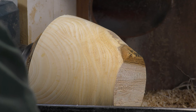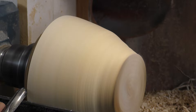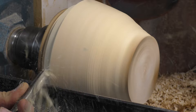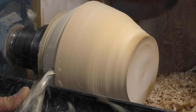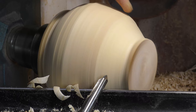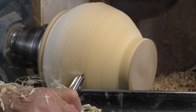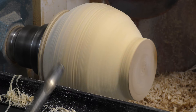Now as far as getting the shape is concerned, I'm going to just round this over at the top - just stay there. Cutting from the smaller to the larger diameter. I'm going to be down on to the plywood backing disc here, that's alright. I'm going to start to pull round the back here. I'm really looking at what's happening up on the top rim. I don't want it too undercut, so that will pretty well do, I think.